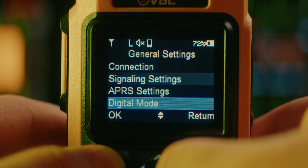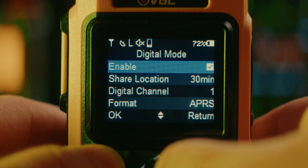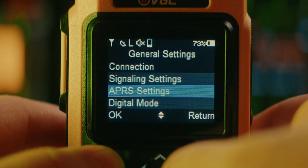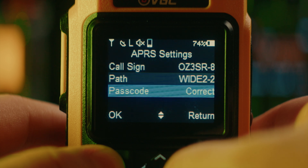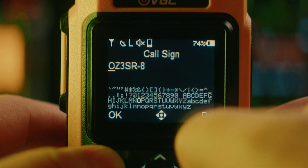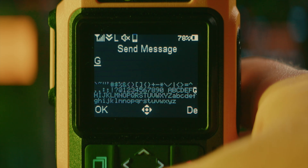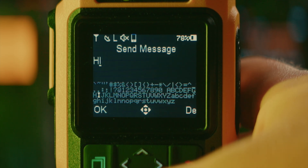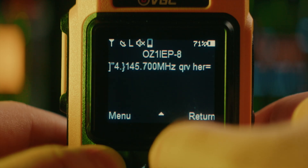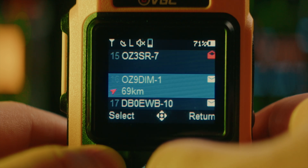The radio supports not only APRS, but also this weird BSS feature, which is a similar custom group messaging feature but not intended for amateur radio use. To switch the radio into APRS mode, you have to put in a password which is linked to your callsign. You can use an online generator to get this password, but it's still a bit weird that you need to put it in. Once you've set up APRS, it will send and receive APRS beacons and messages on the radio, although it displays received messages and station beacons in one combined list — it would be nice to have them separate, like it is in the app.